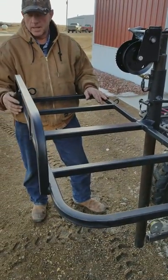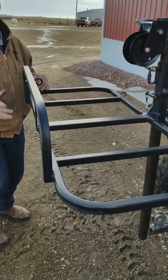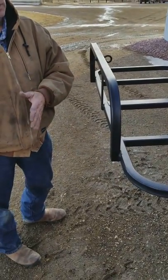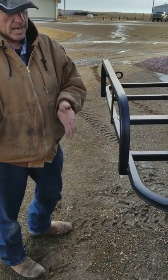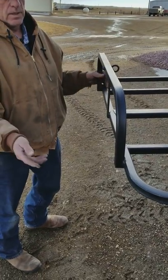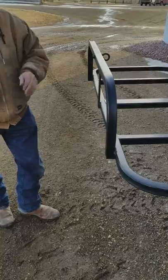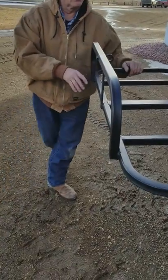The new baskets I'm making, I'm actually going to have this back rail hinged, so when you back up with a deer or whatever you've got loaded, feed bags under the back end of the tailgate of the pickup, you can flip this down and lay it flat, just slide everything off onto the bed of the pickup.